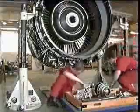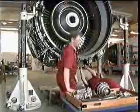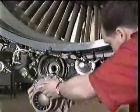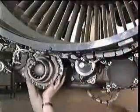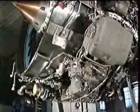That completes the removal and installation of the external gearbox, Module 60. All that remains is to reconnect all the accessories, tubes, wiring looms, and replenish the oil. Then carry out the required checks as specified in the engine manual.